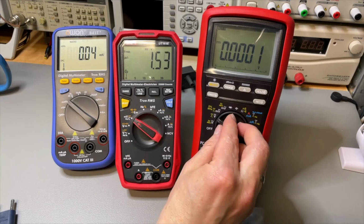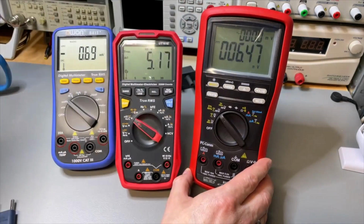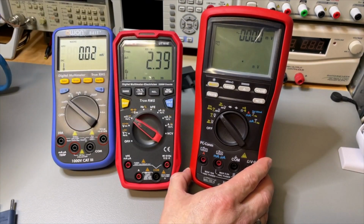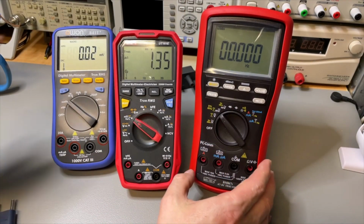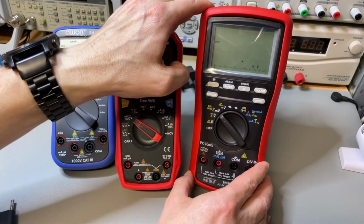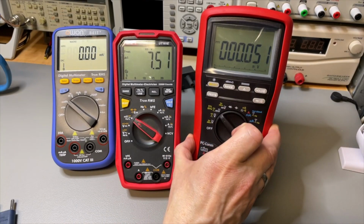And well, I would expect in the Brymen absolutely the same type of options. DC, AC plus DC modes again, also in the millivolts. So that is really again well done on the Brymen with all these extra options. And you can do the frequency also, and I would expect the duty also, and it does. Can we also get an extra digit in the millivolts? Yes. Wow.